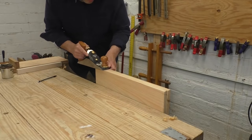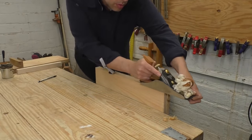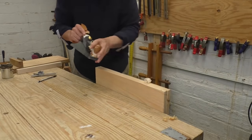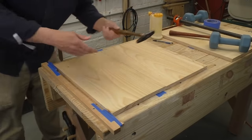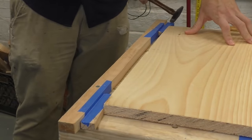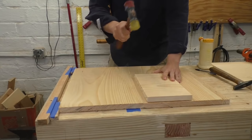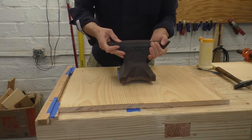There are some aspects of woodworking where glue is not optional — like if I have two boards and I want to join them together to make a larger panel. I'm only going to do that with glue, but I might be able to do it without any clamps. Here I'm making the doors for that big cupboard project — just two big pieces of white pine joined in the middle to make a large panel. Usually you would clamp these, but here's another approach: I'm screwing a couple of battens down to my workbench, putting the panels in between them, and then just tapping in some little hardwood wedges. Those actually give me plenty of clamping power, just as good as using a commercial clamp, especially if I throw a little weight in the middle to keep things from bowing up.